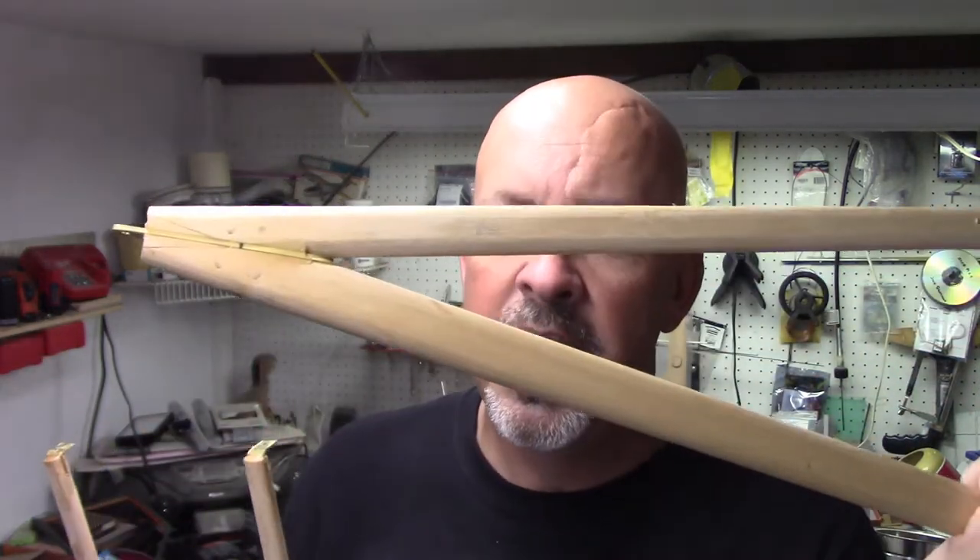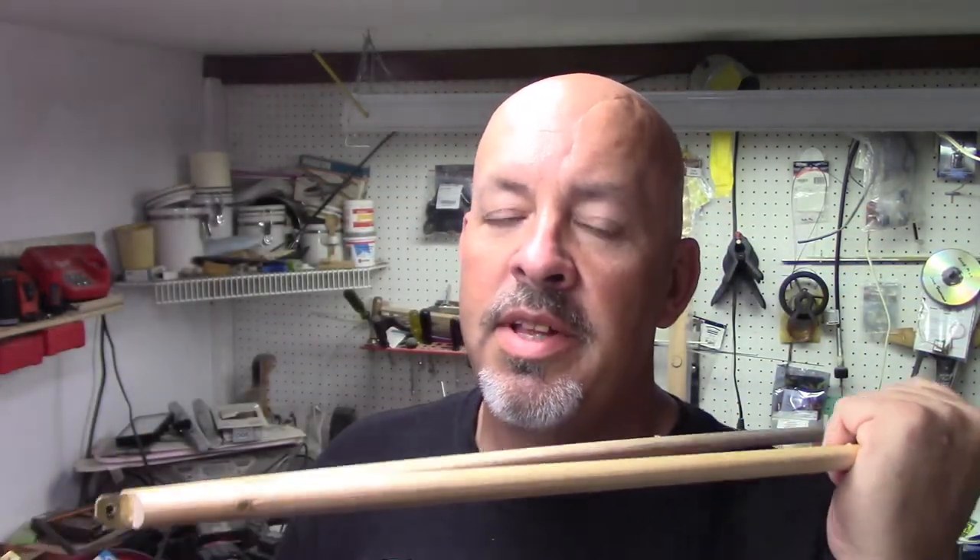It's going to be a really long day — I'll probably be finishing up sometime tonight. If I can get the wings ready to be covered, I've pretty much decided I'm going to get some primer and shoot it with primer, then shoot a couple coats of orange and see how it looks. Because in real life, that was just bare aluminum or bare steel tubing painted. I'm not going to waste time and energy covering this with fabric before I paint it. That's what I've done to all my other planes — literally wood sealed, sanded down, primed, and then shot the paint on it.